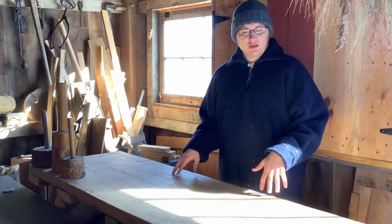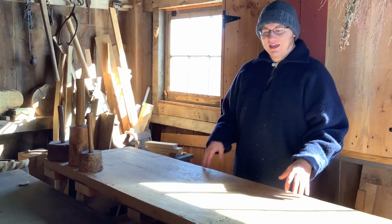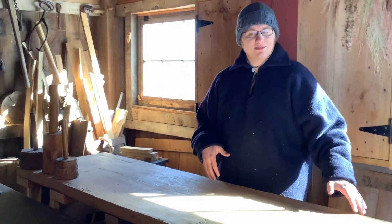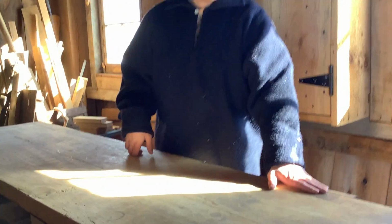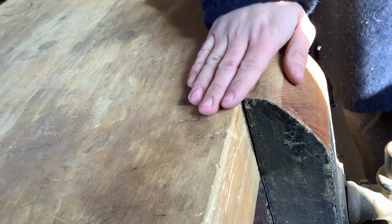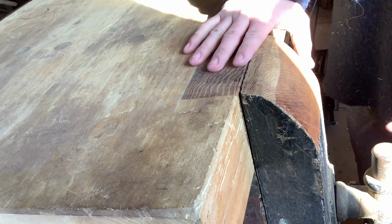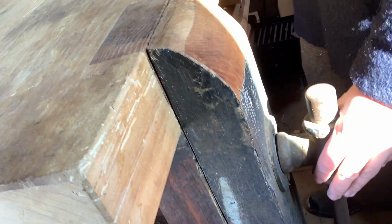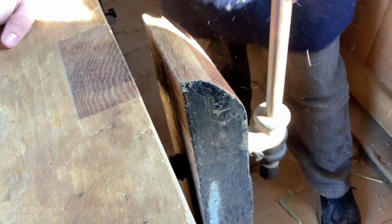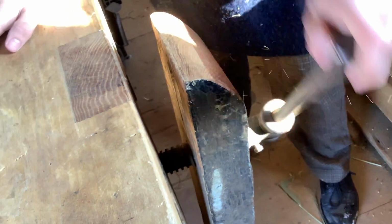So our workbench is a carpenter's workbench, and it's in an English or an American style. We know it's an English or American style by the vises that it has to hold down wood. On our workbench here, we have two different types of vises. We have what's called a leg vise. It is attached to the front of the workbench, and you can open it up. It's called a leg vise because the bottom half of it is actually connected to the leg of our workbench. Open up, we have our two jaws right here that we can put different pieces of work in.